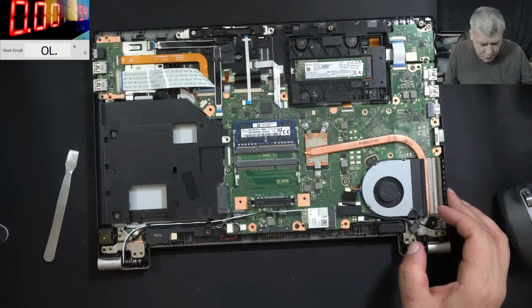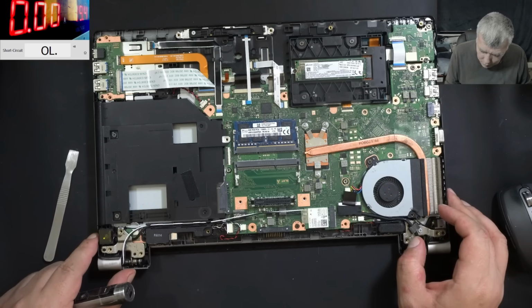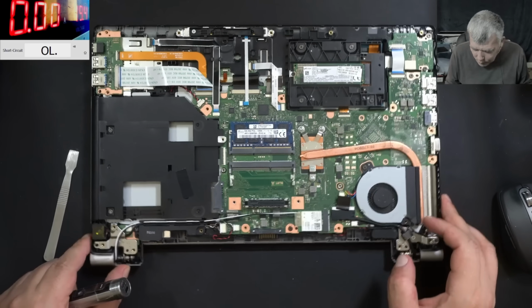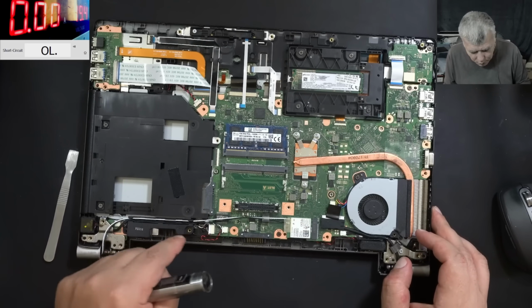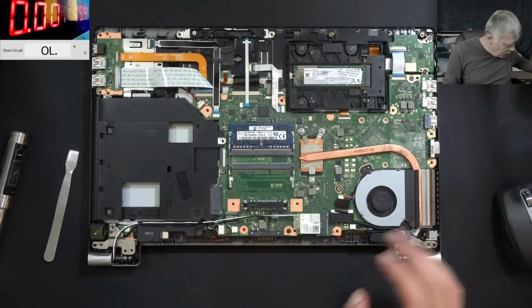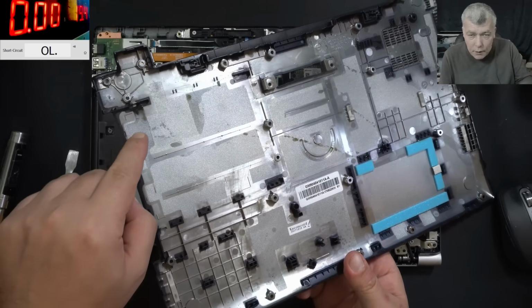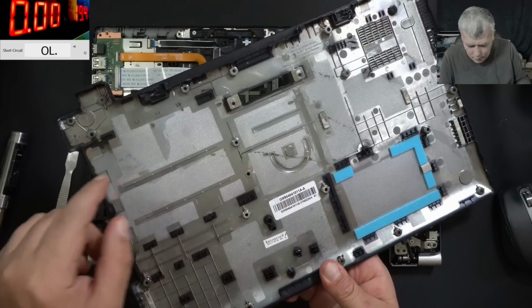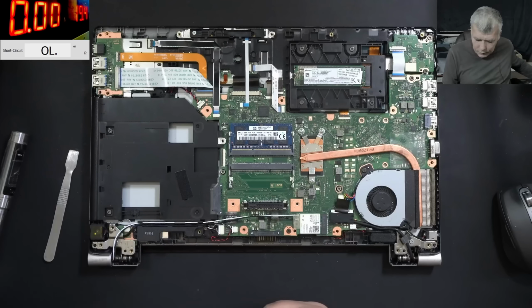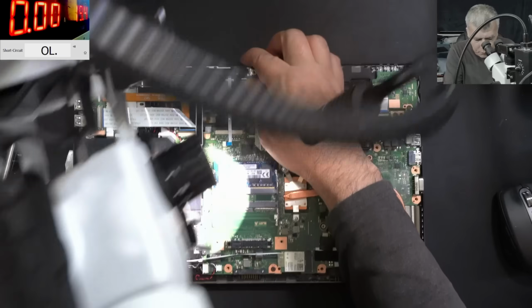The best way to approach this repair is to take the motherboard out, because if we have liquid damage, we have to find it first and clean. But still, the liquid damage is on this side of the board. Yeah, check here. So yeah, the liquid damage came from the back. Okay, then there's no point taking the board out. But we can check this side of the board.